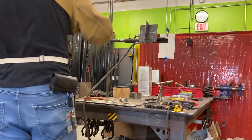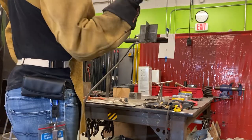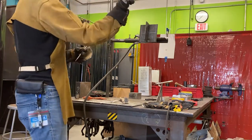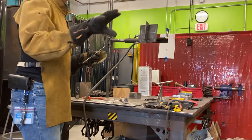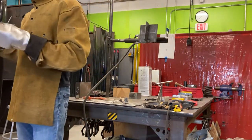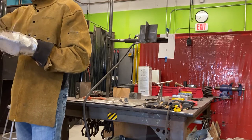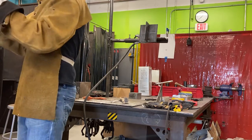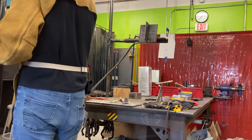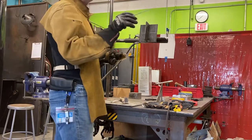That's why all the stubbed rods in that can are there. You're going to need some small bits and pieces. It may be more strategic to string together a bunch of smaller welds than try to do it all in one go. That's a very important lesson here for us. Don't try to bite off too much. It may be easier to do small tie-ins rather than running out partway through. So I want you to think strategy here and really think about how you're going to space things out. That's an important idea here.